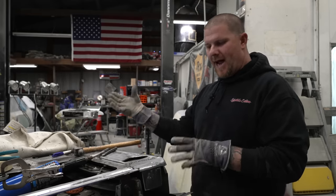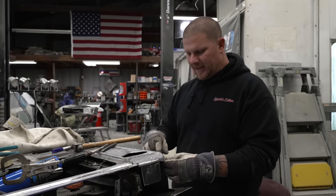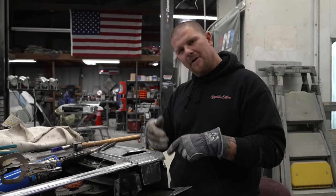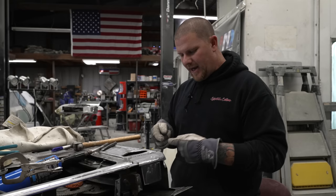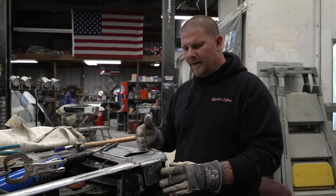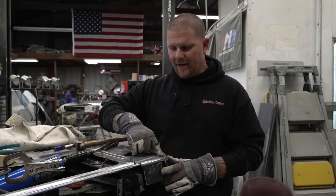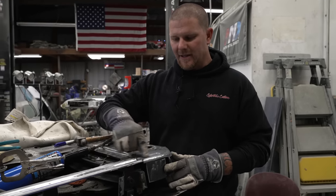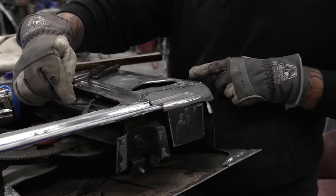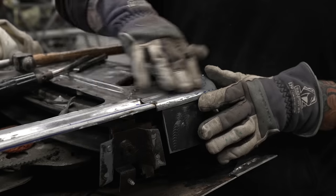We've been going back and forth to get this corner to fit exactly where we want. And you can see even here on this radius, if you're off a little bit, you can go right back to the T-dolly and move it and keep working the edge around till things line up. Now, when it comes to this bead roll that we did in here, you can see there is a substantial difference on the depth. Again, this entire edge is completely covered by a door panel, and I don't want to kill the customer on cost to make this exact.